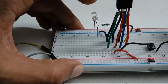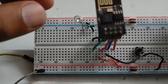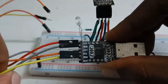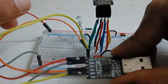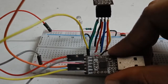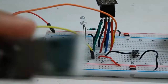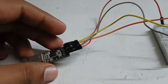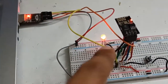Now let's connect the remaining RX and TX. The RXD of the CP2102 will go to TX, and TX here will go to RX — so RX goes to TX and TX goes to RX. Our connection is done. Now let's connect this to the COM port on our laptop.